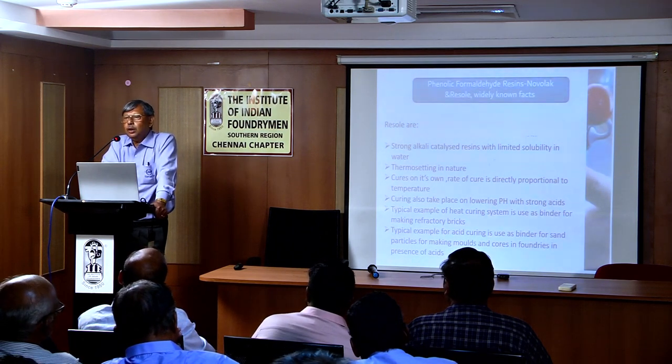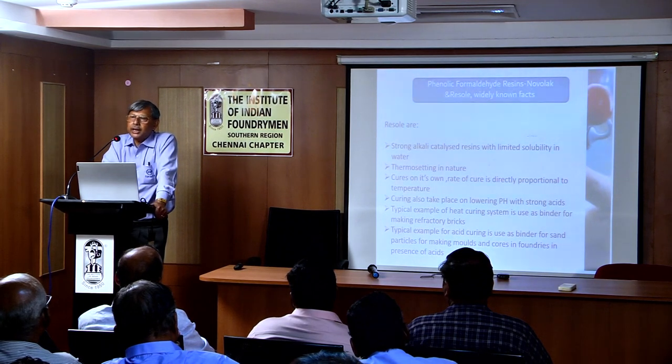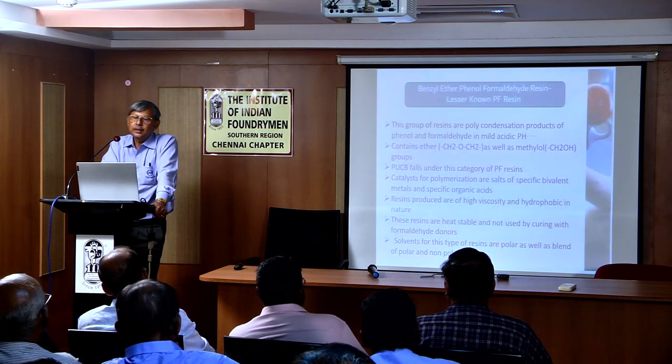And if you see by heating, you must be aware that these bricks are used for furnace lining, and one of the bricks is MagCarbon brick, MgO carbon, and the binder for those is resols. So these are the two main varieties of phenol formaldehyde resin disclosed in the literature.